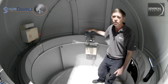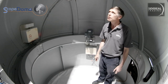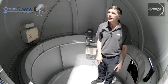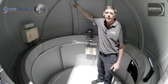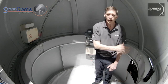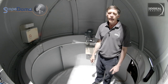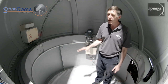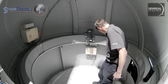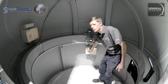The azimuth motor is fairly large and a little bit intrusive, but you're probably not going to be spending a lot of time in the dome yourself. The shutter motor is up on the roof, and there's a limit switch up there and a limit switch down at the bottom, as well as a thermometer. There's also a bay that you can use for a computer or other equipment — it's a large box that you access through an opening. Power comes through the floor into the dome control box — we've just got an extension cord here for demo purposes.